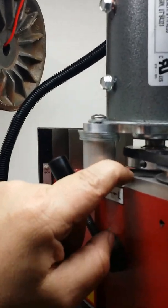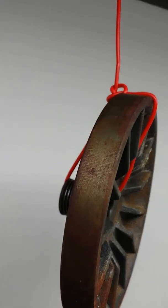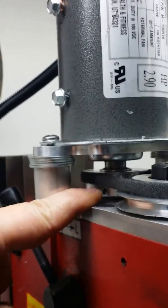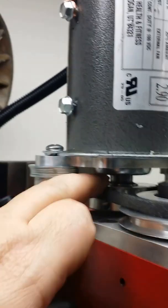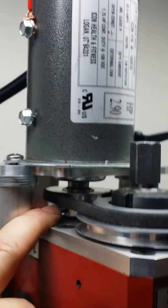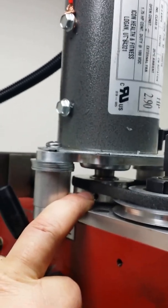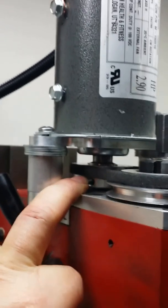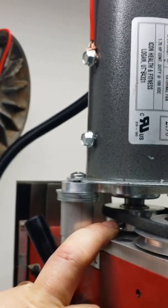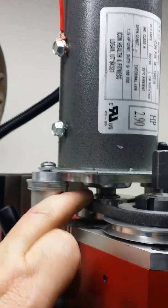These motors come with a long custom shaft that's threaded on one end to adapt the flywheel from the treadmill. I cut that off right at the shaft where the threads stop. What I discovered was the shaft is the bare stock for a five-eighths inch shaft, but it hadn't been turned down to five-eighths — it was roughly 0.66 inches. A friend with a lathe turned it down for me.